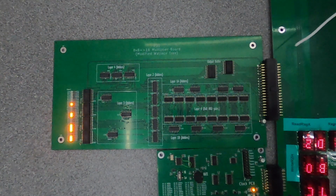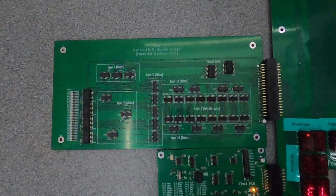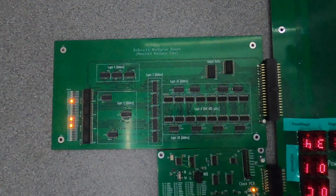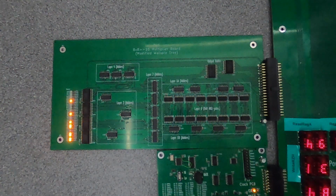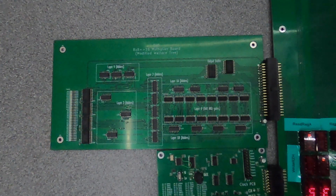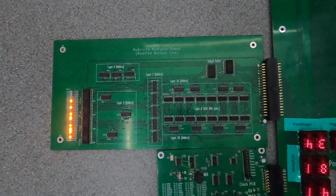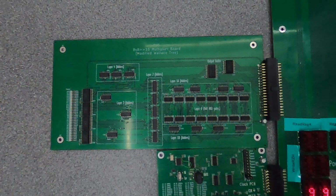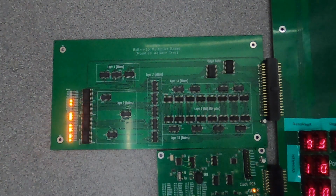One of them is the register write bus, and the other one is a special bus that only goes to a special register, which is called register ZH. And that allows us to have a 16-bit result from the multiplier and store the whole thing. So you get two numbers coming in, 8-bit by 8-bit, and you get a 16-bit output. It doesn't matter if you want to do signed or unsigned multipliers. As far as the logic is concerned, they're exactly the same. If you interpret the input numbers as signed, then you interpret the output number as signed and you'll get the right value.